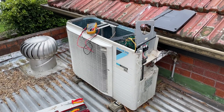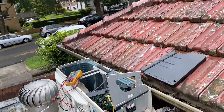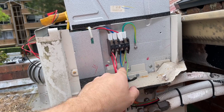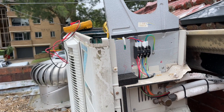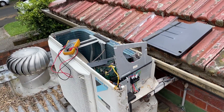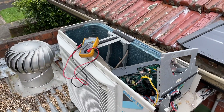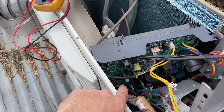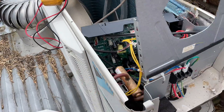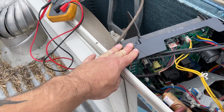When you have this fault it most likely means you have a faulty outdoor PC board. The first thing I do is make sure there's power getting to the outdoor unit — line, neutral, earth should be 240 volts. There are two fuses on the board; the first one has 240 volts going through it, so I know there's power being supplied from the switchboard to the unit and to the PC board.